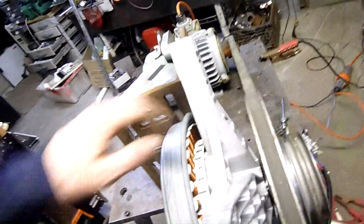I'll give it credit — it did well. I'm going to have to try this against the plasma panel. The stator is still stone cold and happy. The LEDs, however — only about half of them are probably blown. Probably one early LED blew and took out the rest of that chain. There was fire down here. There's a bit of a burn — that one burnt before the LED. I've probably arced over the pins. There were lots of orange flashes. That one's hanging off at a bad angle — that one's desoldered itself.